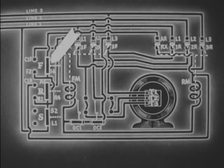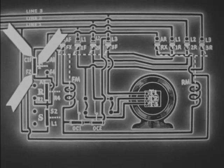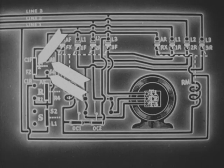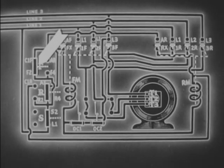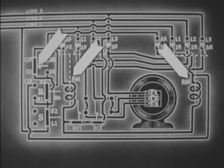Pushing the forward button makes contact between C1F and F2 and at the same time breaks the contact between AR and F4, making it impossible for both coils to be energized at the same time. This is an electrical interlock.